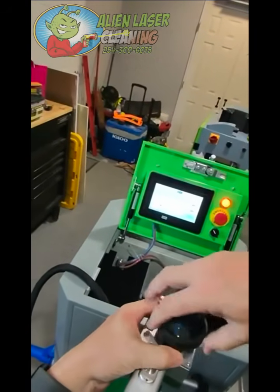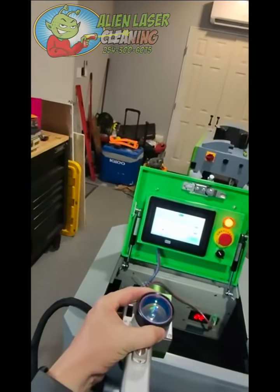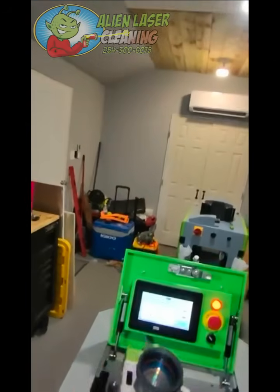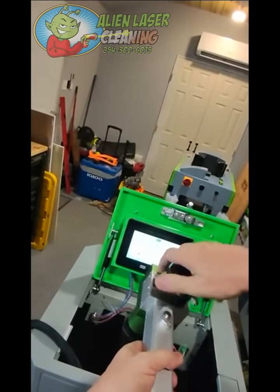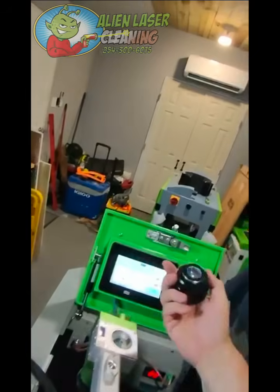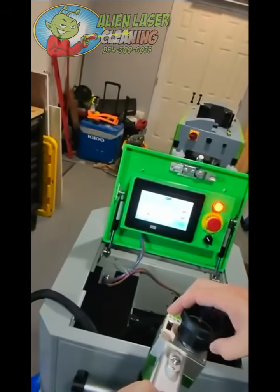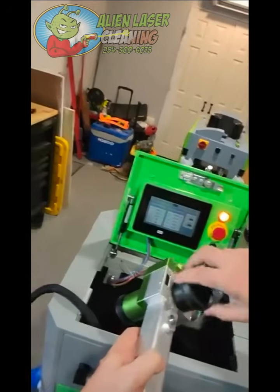You take the air wand off right here - there's a screw that pops off and then you just pop off your safety lens, put in a new one, clean this with your wipeys, whatever you have to do. Also, if the safety lens gets damaged beyond control, you have to change what's called the focal lens, which is the next lens right underneath here. We've made it to where all you have to do is basically just untwist this - you've got to be really careful to make sure you don't get any debris in there - but then this comes off and your focal lens is right there. Makes it super simple to work on. If you get anything on the crystals in there, you can basically just clean those as well. The other ones were really difficult - most people didn't like them because they were a pain to change out. We've just made it really simple.